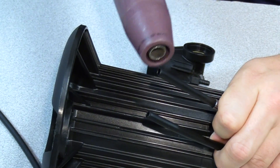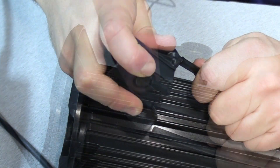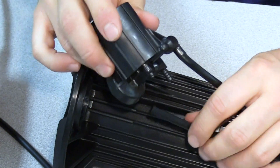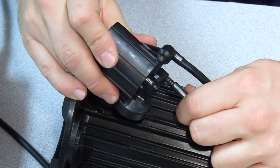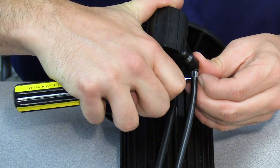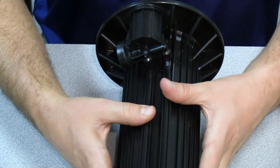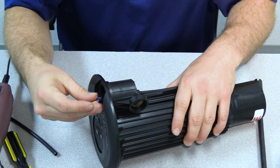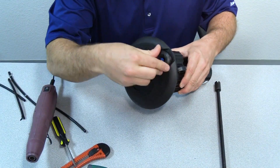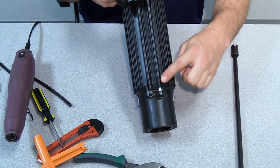Now let's attach the PRS housing. We can heat both of these tubes simultaneously. Remember, the longer high pressure tube is attached to the higher elbow and the shorter low pressure tube is attached to the lower elbow. Carefully slide the retention clip into place and tuck the tubes into their channels on the case. Replace the PRS cartridge and PRS retainer nut and that's it! We've successfully replaced the PRS tubing on a Rainbird Eagle Series rotor case.